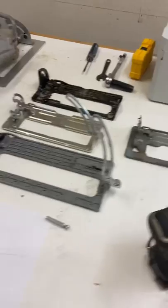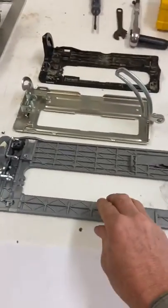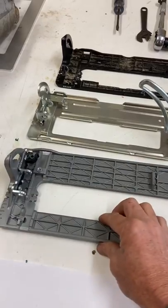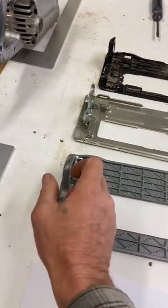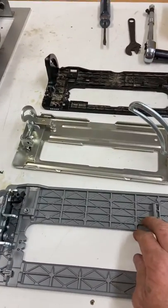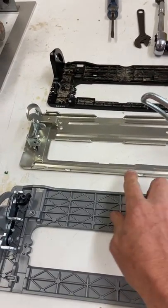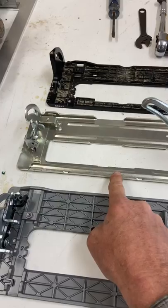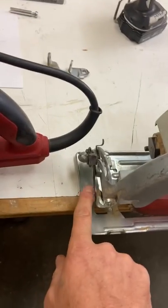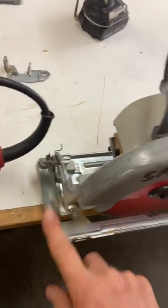Skill saw has been monkeying with their tables trying to make them lighter, so they have these cast aluminum tables and they thickened their protractors. For years they used this table here or some variation thereof, and it was always the same pointers — if the pointer varied in configuration it was still accurate.